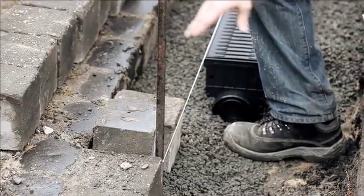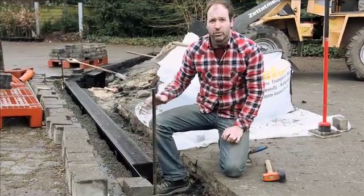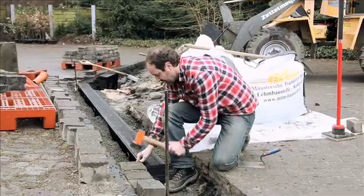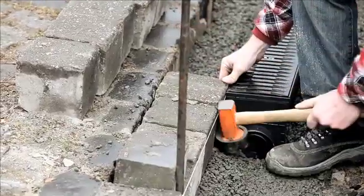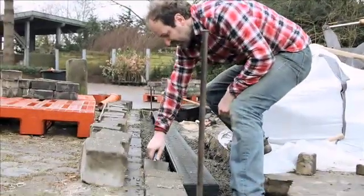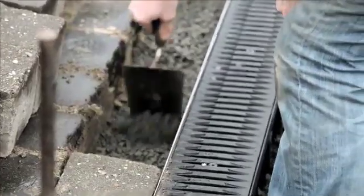As you can see, we are already creating somewhat of a downslope, which is exactly what is needed. The water should be able to flow easily into the channel and not remain on the surface. The better the subsurface preparation, the easier the work. Go over it again with a trowel — the concrete can be compressed by about 1 cm.